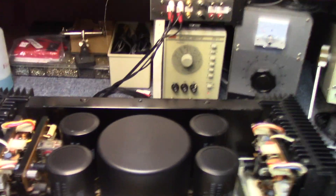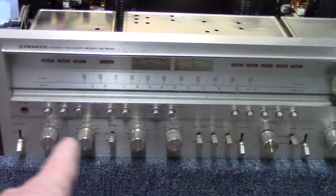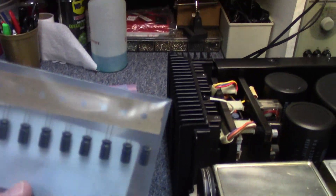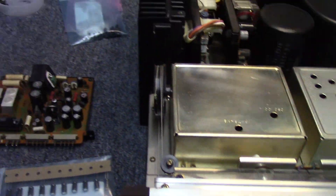We'll pick back up and show some of the progress made while waiting for parts. Did some interior cleaning - not running it through a car wash or dishwasher, just wiping everything reachable with a towel. One big focal point was the heat sinks - removed the output covers, cleaned everything there, and ran a towel through all the slots front and back. As for the caps, ordered Panasonic 47 mic at 50 volt, which should be fine. We marked the ones that really need replacing; all others were perfectly fine according to ESR.